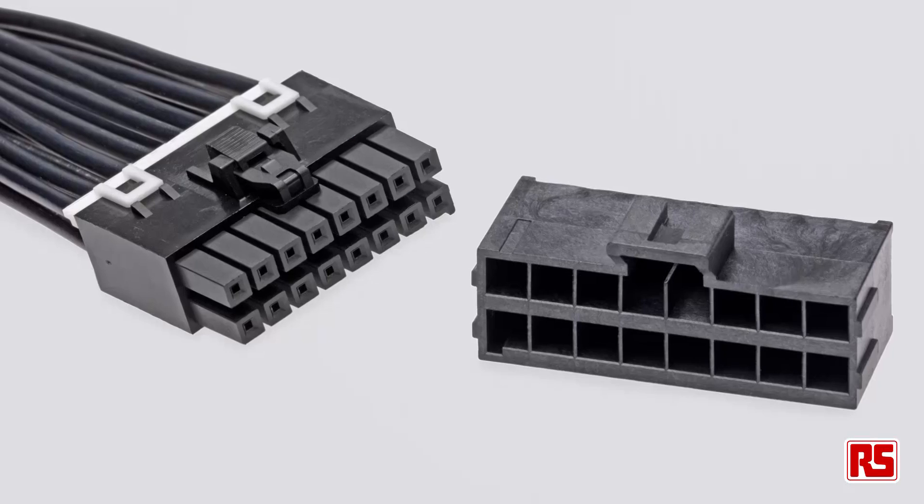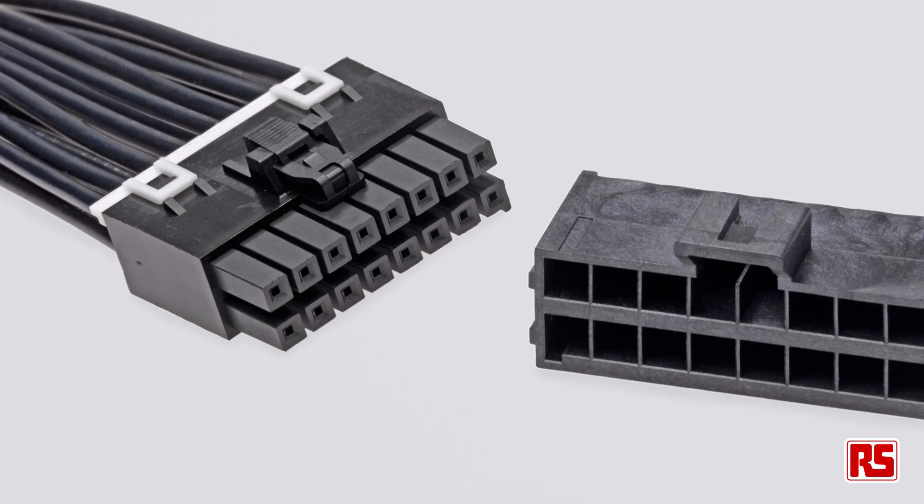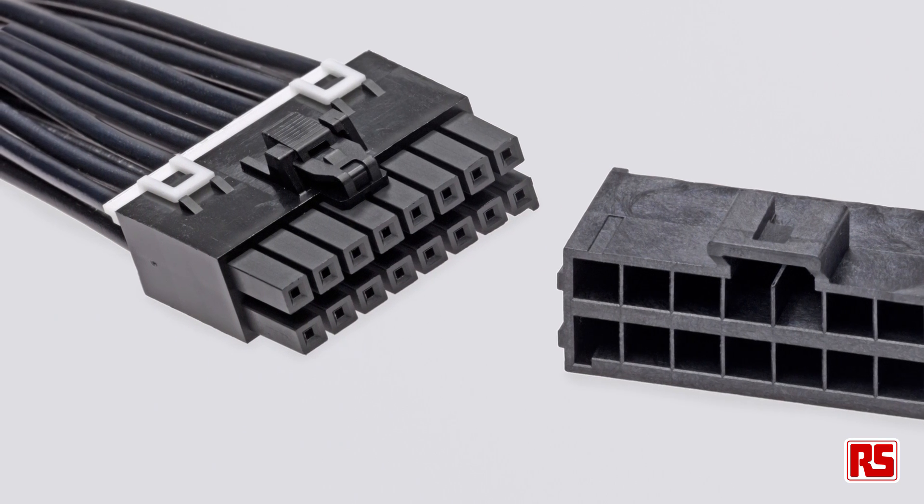The family is not yet complete. Later in 2015 the UltraFIT connector will be introduced, using a 3.5 millimeter pitch as a wire-to-board connector capable of up to 14 amps. And following the UltraFIT will be the NanoFIT, on a 2.5 millimeter pitch for current up to 5 amps.